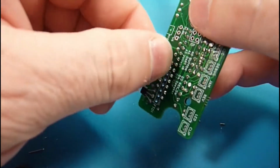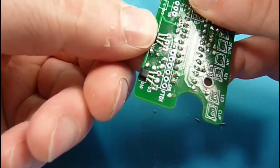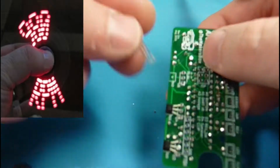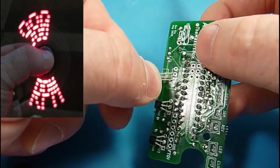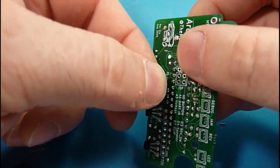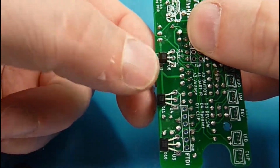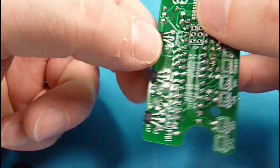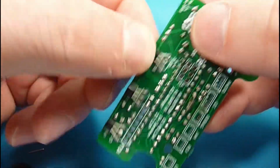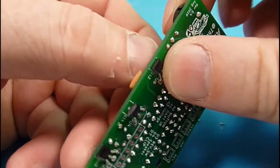I used a Hall effect sensor for my Geek Spinner kit, where it measured when the spinner was rotating around, it knew when it reached a certain point, and that required a unipolar Hall effect sensor, so you had to know which way the magnetic field was pointing, which required me to know which way the magnet was on the cap, and that was quite a hassle. And I wanted to use these guys. These are omnipolar, so they'll react to either a north or south pole.